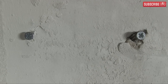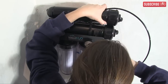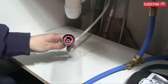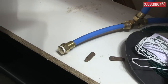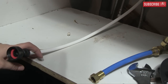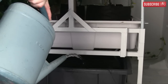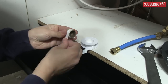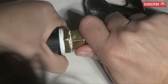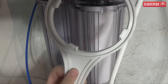Next, mount the unit on your wall. Locate your RO machine away from the glare of your grow lights, or you run the risk of algae issues inside your machine. Feed the black waste pipe down your drain. Then connect the other end of the white tubing to the mains water supply — remember to switch it off first, unless you enjoy getting wet. We've got a T-piece already in place to supply water from the faucet and the RO machine at the same time. I prefer this method as 10 to 20% tap water mixed with your RO water really helps raise and stabilize the pH of your nutrient solution. Connect the pipe — a little PTFE or thread seal tape is sometimes handy. Before turning on the water supply, make sure the sediment and coconut carbon filters are screwed on tightly. Just use your hands for this; the supplied wrench is actually for unscrewing.